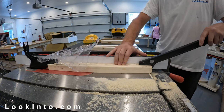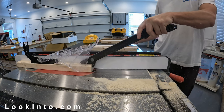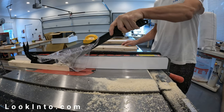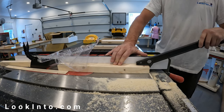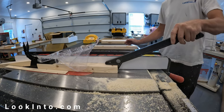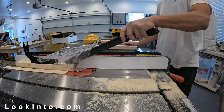The seat is made from three sections of 2x4. I cut them to 16 inches long, ripped a slice off the edges so they had a flat surface, and glued them together to create a slab that was roughly 10x16 inches. A day later when the glue was dry, I fed the slab through the planer to make both sides flat with a final thickness of 1.25 inches. Then I trimmed all sides for a final 15.75 x 9.75 size.